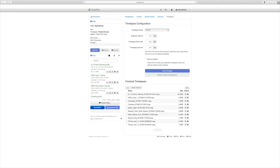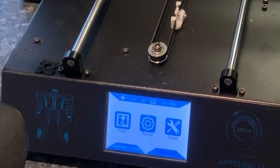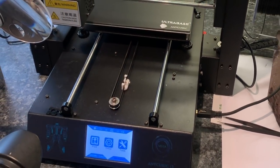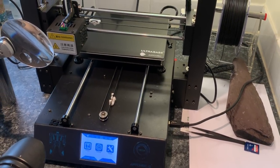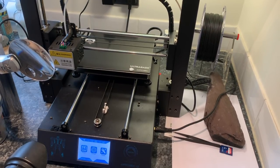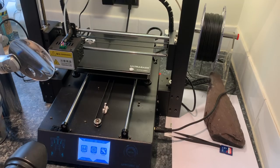To print something I can either drag and drop or click upload and select my G-Code file. It's better to do the conversion in Cura rather than letting OctoPrint convert STL files itself. Then I press print. You can see on screen that the temperature is starting to rise on the base plate — it's heating up to 60 degrees, which is what's set for PLA. When that's heated, the nozzle heats up and then printing starts. When doing small prints, skirts didn't work — some didn't stick — so I switched to a brim and it was much happier.